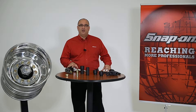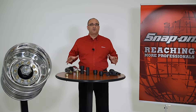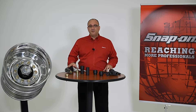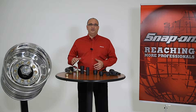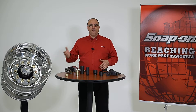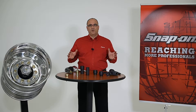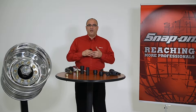The first step is to choose a pneumatic torque wrench and there are two available that work in our system of wheel torque accessories. They're both three-quarter inch drive. One has a torque capacity of up to 500 foot-pounds, the other up to 1,285 foot-pounds. When selecting a torque product we always recommend that you use something more toward the middle range of that torque device. So if you're going to be torquing at about 475 foot-pounds we'd probably want to go up to the higher capacity gun so that we're working more in the middle of the range. We would never want to use that gun at the upper end of the range all the time.